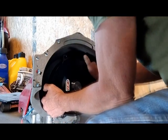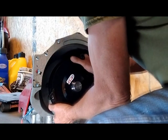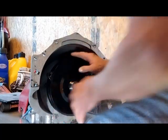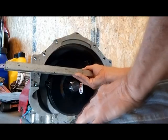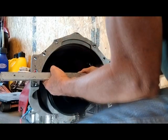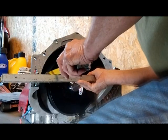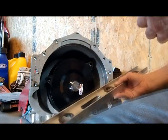Just turn it clockwise and put some pressure on it, wiggle it around. Maybe it did only need two clicks — we're back there in the back. We're just going to work it a little bit to make sure. To double-check, take a flat edge across your bell housing, measure to one of the converter bolt tabs, and you should have about an inch — it should be recessed in there an inch. We are exactly just a hair over one inch, so we're going to call that good.